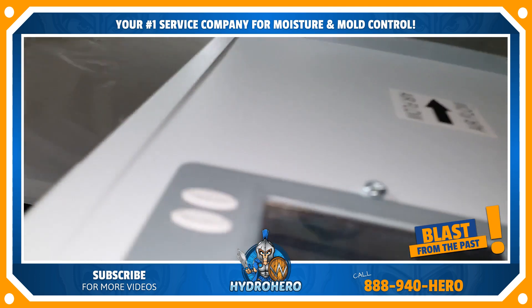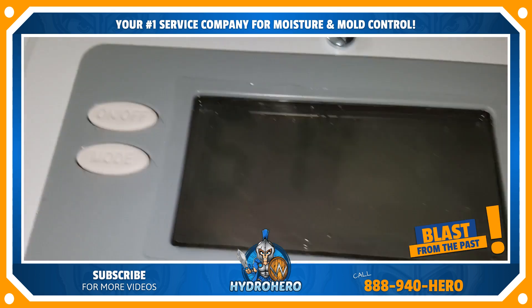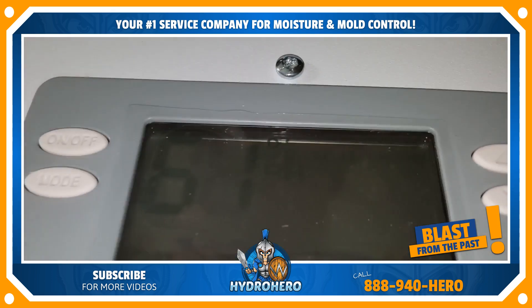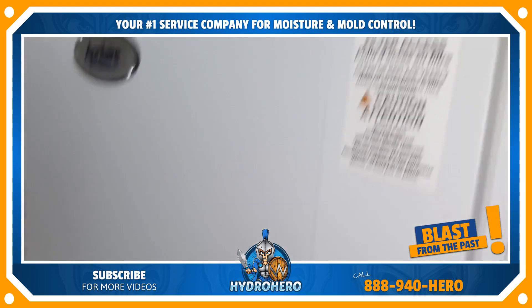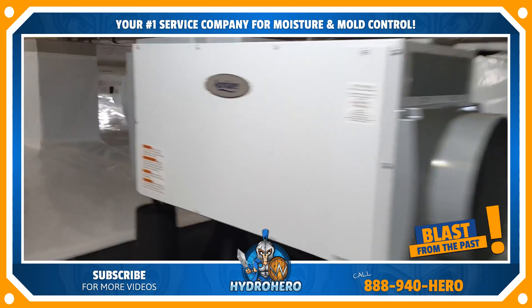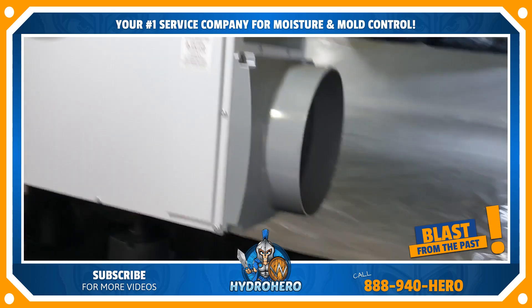They also have a digital control here. We just turned this one on so it has a while to go — it's currently at 61 percent relative humidity. We're going to have that drop down to 45 by tomorrow, and that's where we'll keep it. At 60 percent you can start having microbial growth, so you want to keep it well below that — really between 30 and 50 percent relative humidity is perfect.